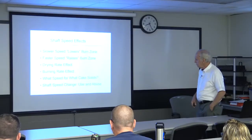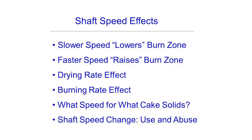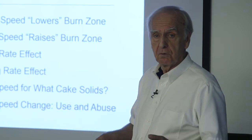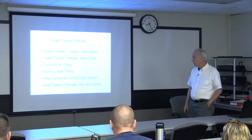As we've talked before, we don't coach you to use the shaft speed as a quick and dirty fix for controlling the burn zone. If you've got to move the burn zone up and down, use the burners — shaft speed is like changing gears, that's a long-term change. You do have cases where you're not using any burners at all; in that case you're down to adjusting the shaft speed or the air to take care of the burn zone. But if you're using the burners, use those to control where you're burning.